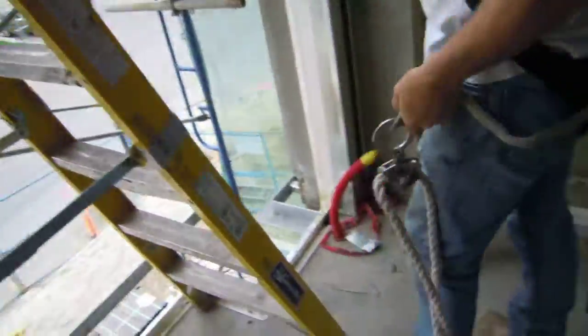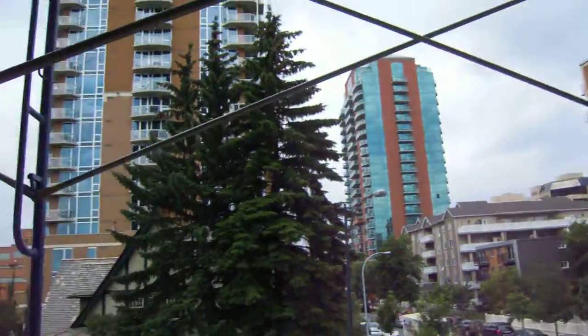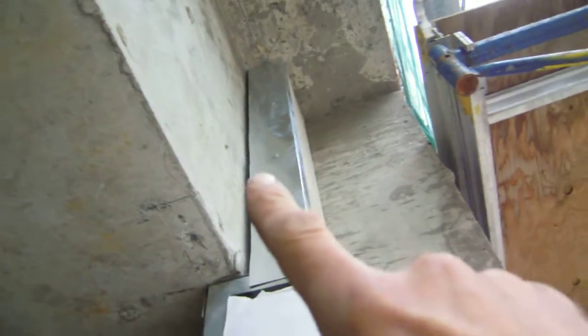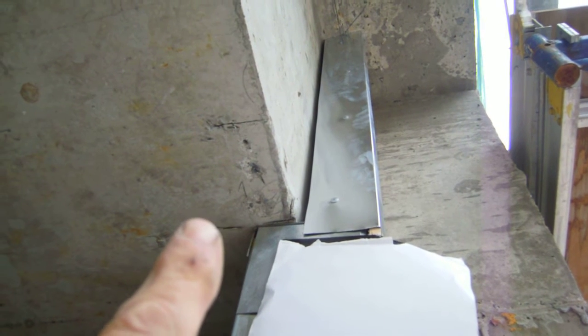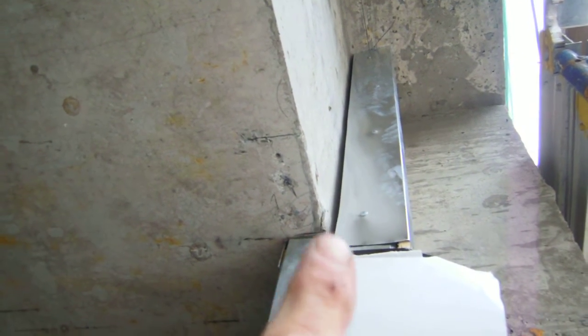Everything in this pocket. Working on some membrane. Up there, there's a piece of galvanized that was added to close the gap that's here. Because we're not supposed to — what's the terminology we use in the glazing field? Tenting. No tenting allowed. That means covering a gap that's greater than — I'm not sure what the standard is. I think it's three-eighths, or even a quarter inch is probably the maximum they allow for. There's still three-eighths there. This is after they fixed the gap that was one inch, and still left three-eighths.